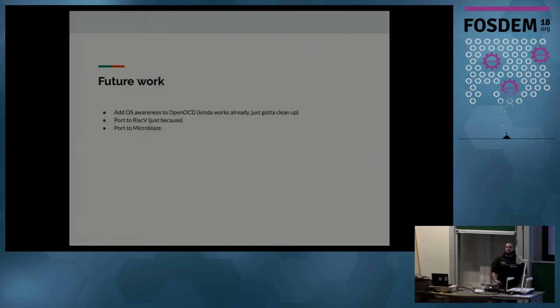Power-wise, it might be definitely worth to use an RTOS because it's really easy to get to sleep right. You just basically have to make sure the idle task gets run at the right moment, as opposed to making sure from every possible state you go to sleep the correct way. I just personally found it easier to write code like that. I've done bare metal firmware that doesn't have task switching before. It makes it easier to reuse things. So there's pros and cons. Of course, you have a size overhead for having all this extra stack. So if you're size constrained, for example, that might be something you want to consider. If you have a bigger system that has an MPU, or even an MMU, that definitely would be worth considering an RTOS. So yeah, I would look at that.